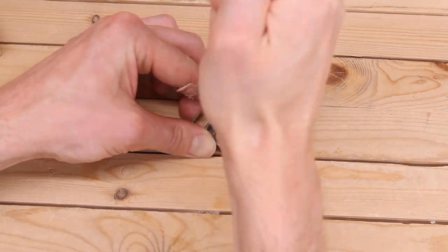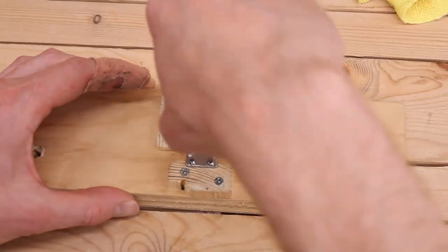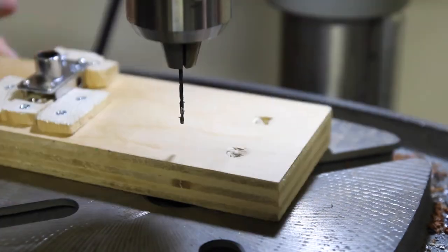To repair these, we're going to replace the press-fit pins with screws. This provides the advantages of them never falling apart, and if you ever need to switch the key to the other side, all you have to do is unscrew the back plate and then flip the key to the other side.